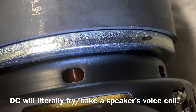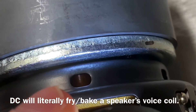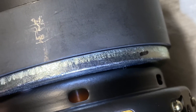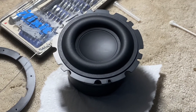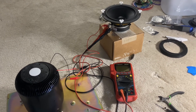Good. Not so good. So that is why this woofer, although it looks good, smells a little cooked — due to up to three volts of DC offset this thing was putting out.